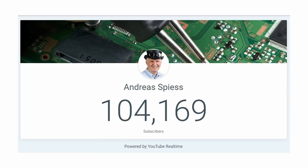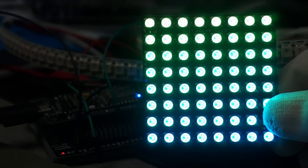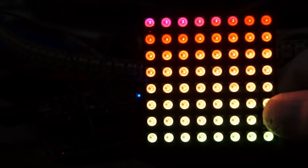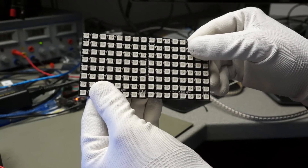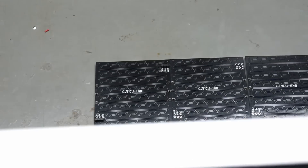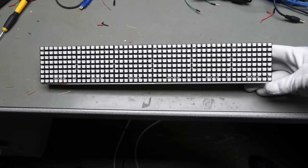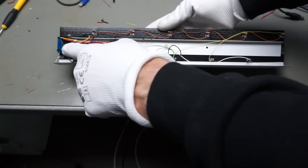We are ready to start the project: my new subscriber counter. Because I passed 100,000 subscribers and the old counter only has 5 digits, I need a new one. I will use those relatively new 8x8 pixel PCBs tested before — they can easily be combined because they fit perfectly together and can be extended in both directions. I bought a set of 10 matrices and will use 6 of them. Six digits will last a long time. I only have to stick them to an aluminum bar and mount the electronics on the back — no box needed.